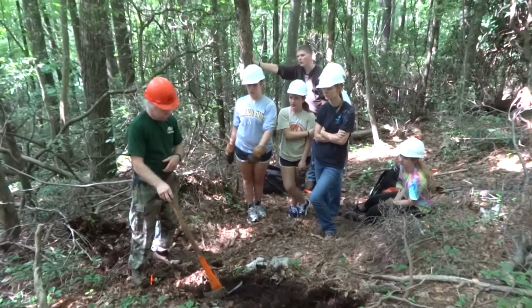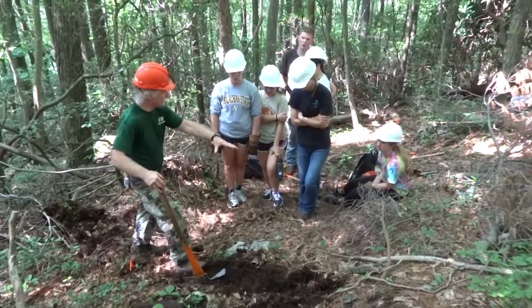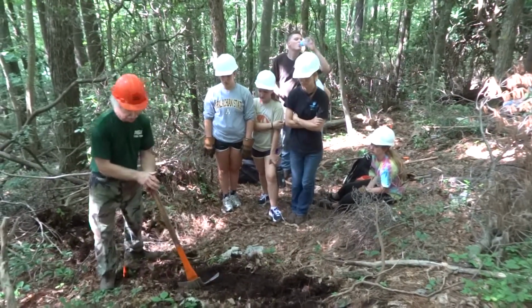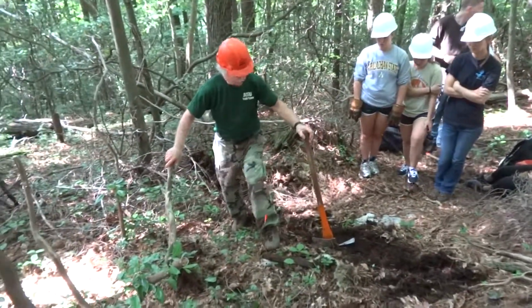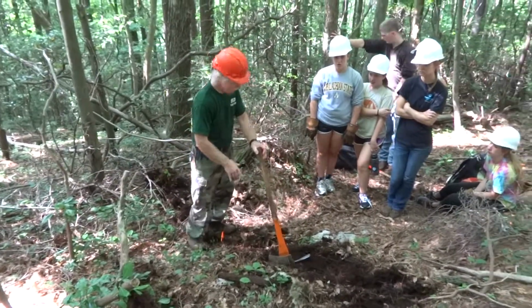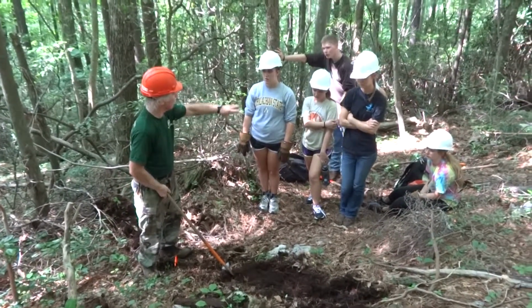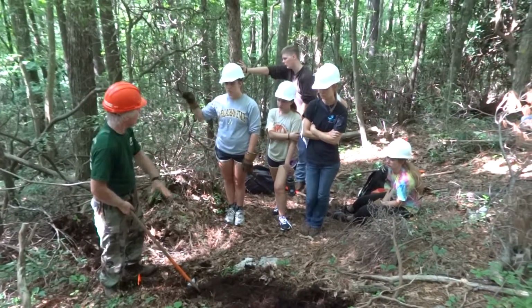So we're going to get those up? Okay. Now these rocks, as you were saying, when you dig out a rock, put it up top. And these bigger rocks, you can put right along your flag line. Level this out first, and then put your rock in, and we'll build a rock wall on the right side, like you saw in a couple of places coming up.